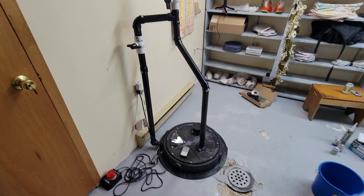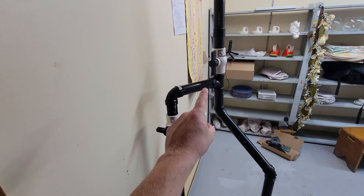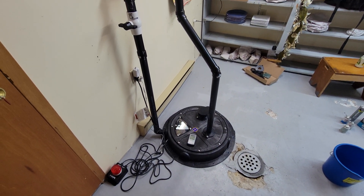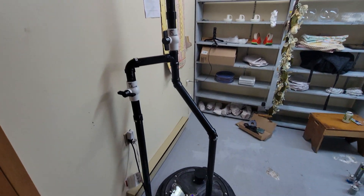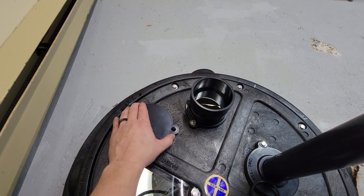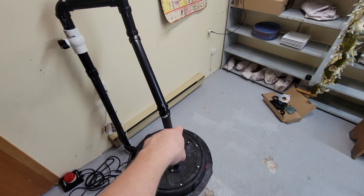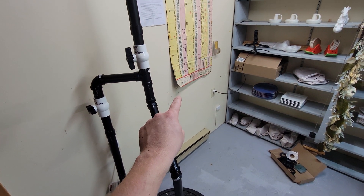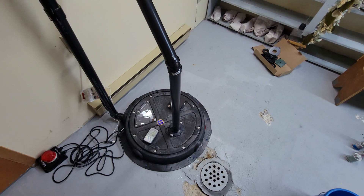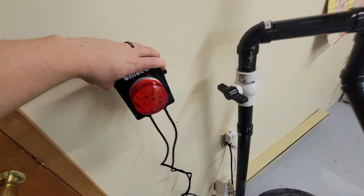We're at the end of stage one and day one. The full sump pit cover is fully installed and everything is cemented in place. We tested both winter mode and summer mode for pumping out of the sump pit and there are no leaks. The sump pump portion of the plumbing is done and the lid is fully installed. Tomorrow we'll work on installing the radon mitigation fan - it'll come three inch out of the lid up to the fan, then four inch up between the floor joists and out of the house. We also tested the flood level alarm and will mount that tomorrow.